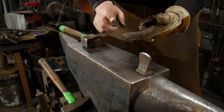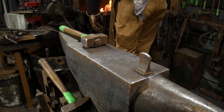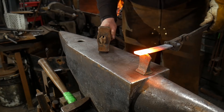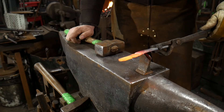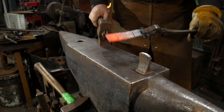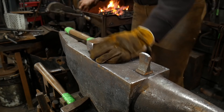The way we're going to make this weld is we're going to notch it and fold it back on itself, notch it again and fold it back on itself, then weld up the billet. This is just a piece of quarter inch by one inch mild steel bar — nothing fancy, no high carbon steel, just a practice piece. I'm going to take a bite on it about one inch, start marking out some cubed sections, flip it over 180 degrees and hammer it on the other side, then again 180 degrees, putting a notch in to help bend it where we need it.